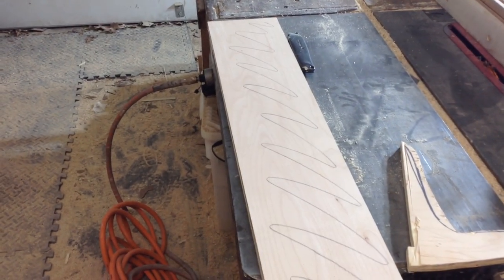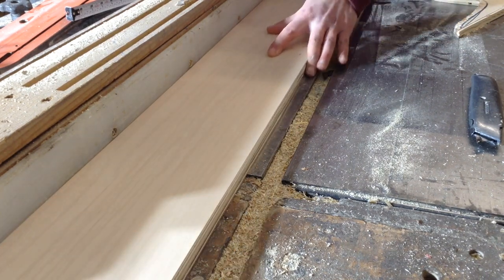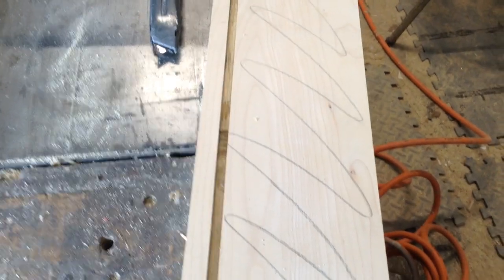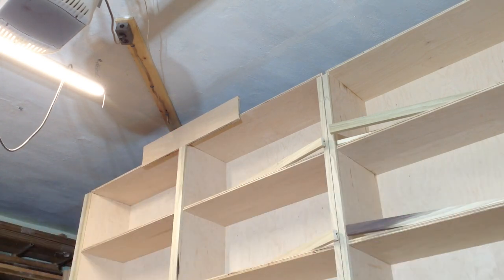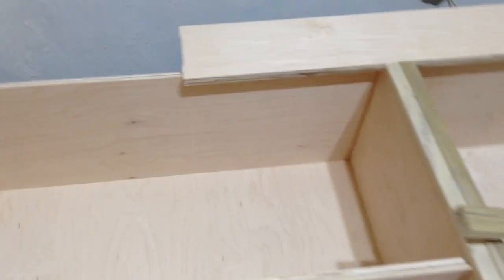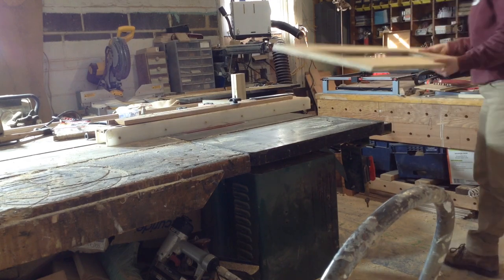This won't fit in the shop, so I test-cut the groove for this on a scrap piece of plywood. I set it up in place and then pretty much crossed my fingers and hoped that this all worked out in the space because there was no way to do this beforehand. This groove is the exact same groove as I put on the entire face frame — a really simple quarter-inch dado. And then that fits in the receiving groove on the top side of the cabinet. You can get a visual idea now of how that's all going to set in place, and that seemed to work pretty well. I narrowed that in and then I could put that groove on my panels.